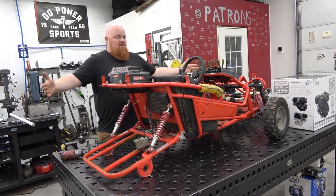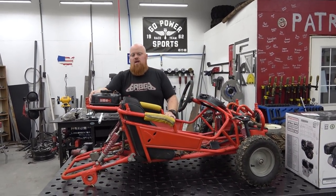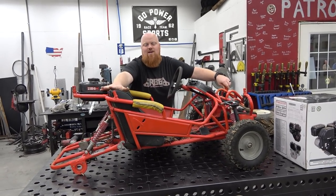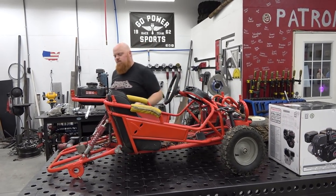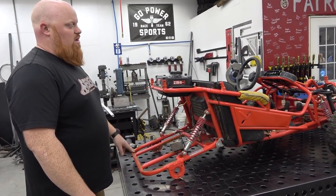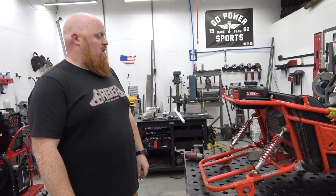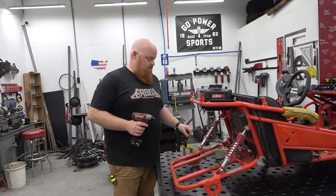And this is a tiny little full suspension go-kart. Really cool and unique little frame. And then we got to build a roll cage that's unboltable. The reason he wants it unboltable, to use these original stubs, is so he can sit on the chassis right here while he gets his son used to it, and then he can bolt the cage back on. So we're gonna pull this swing arm off and start modifying it first, get it thrown back on with the engine, and then we can go on to the brakes. I don't know if we're gonna use the original brake caliper. We might switch it over to hydraulic and stuff. Yeah, let's knock this out. We got basically 5 days to get it to him, so let's see how quick we can get this done.